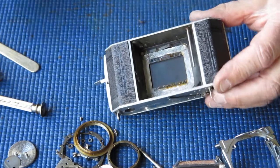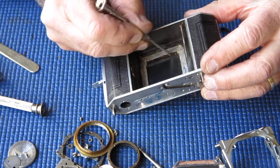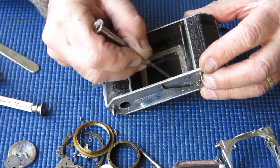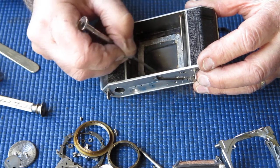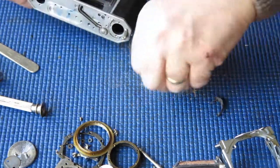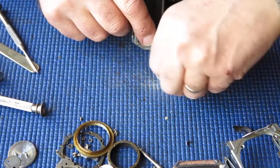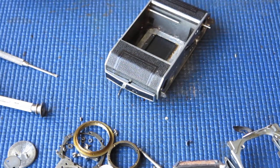So there we have it — that's all off. You can possibly see the colour here — this is a dark brown colour. That'll be the shellac where it was glued on, and it's just letting go with no hold on that painted surface at all. And probably the same here — as I run the screwdriver tip across it, it's just flaking off. Another stray washer — I know what that is. There are two of those, one top and one bottom of the struts where they fit into the body. So that's the strip-down progressing — next I need to get this leather off.